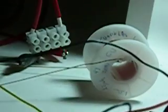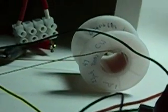Now, one of the next things I'm going to do is take and put one of those primaries in series with that air core. It's all air core, okay? And so I'll be able to then add very, very little inductance, probably huge capacitance for the voltage I'm running at, and see if I can maintain those operating specs with that extra coil in series. It's not really a coil. I mean, it's a typical standard Tesla primary. And the ohmage is 0.01 ohms. Very, very small henries. And I haven't even tried the capacitance yet, but that's next. So that's what I've got for this, adding to this setup next.